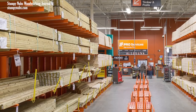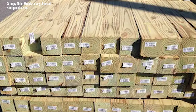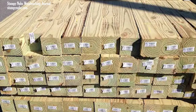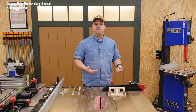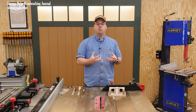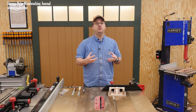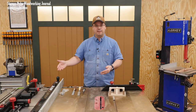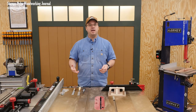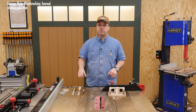First is of course treated lumber. This is typically a softwood that's been infused with chemicals to slow decay. It's not a bad choice for decks and other large structures, but I don't recommend treated lumber for benches, tables, and chairs because by its very nature it's wet and unstable. As it dries you can guarantee it's going to warp if it's not held fast on a robust frame such as on a deck, and the chemicals inside it are not intended for regular skin contact or anything related to serving food.